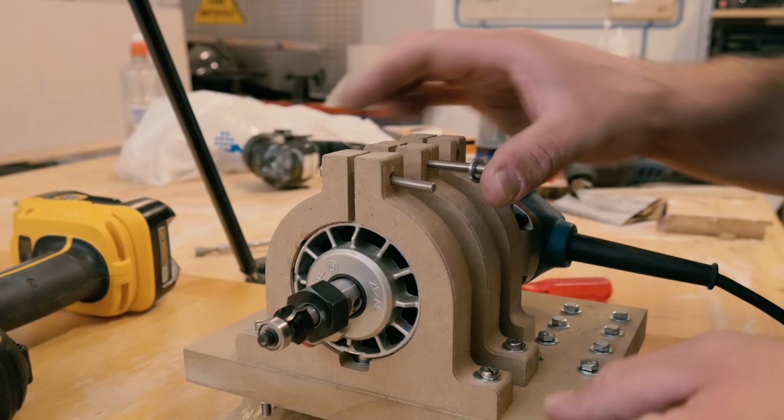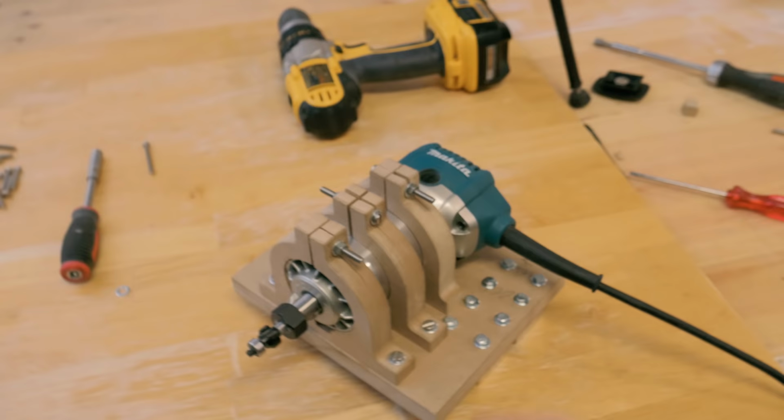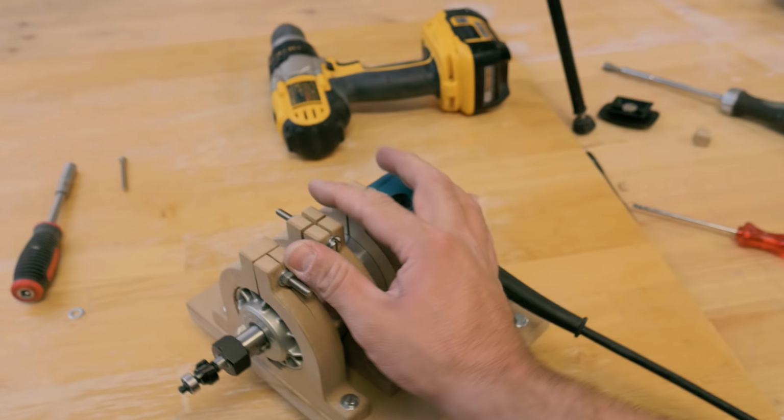Let me show you something. The MDF material has a tendency to crack between the layers in the MDF. If you're working with MDF, you have to watch out for this, and me too. I learned that now. But here I want to make some pieces between the MDF here, and so this will tighten together just fine. Here we have the Y-axis plate.